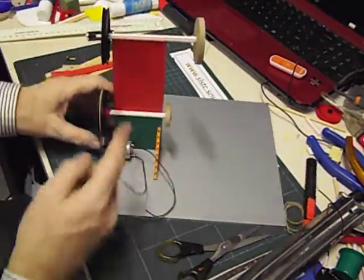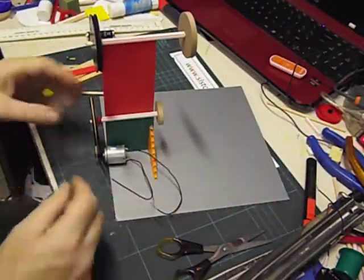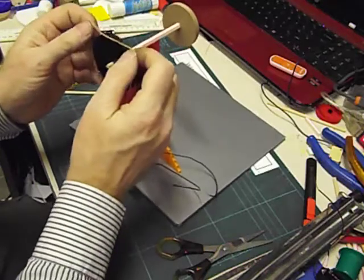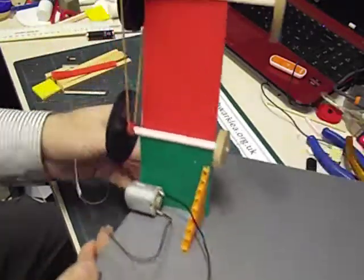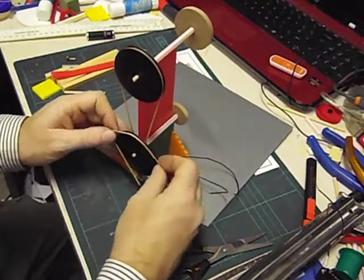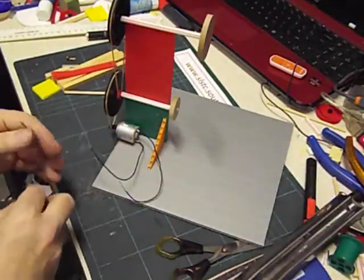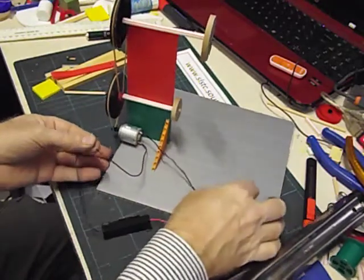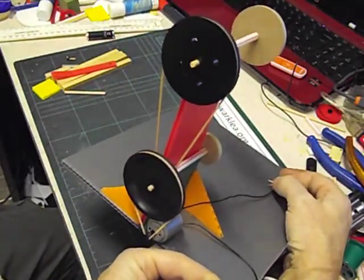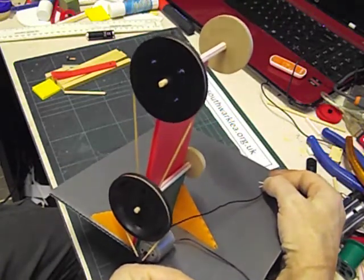On the other end we're going to have the second of the large pulleys — yes, that's going on quite nicely. We're going to connect that large pulley to the red pulley there with a number 24 elastic band. I do have to take the number 18 off temporarily to get that on — slip it over the red pulley and then over the large pulley. Now we can put the number 18 elastic band back on. So now we've got two sets of pulleys. You can see that the upper pulley is going at a nice slow speed — small to big slows things down, and to get that speed we've had to use two pairs of pulleys.